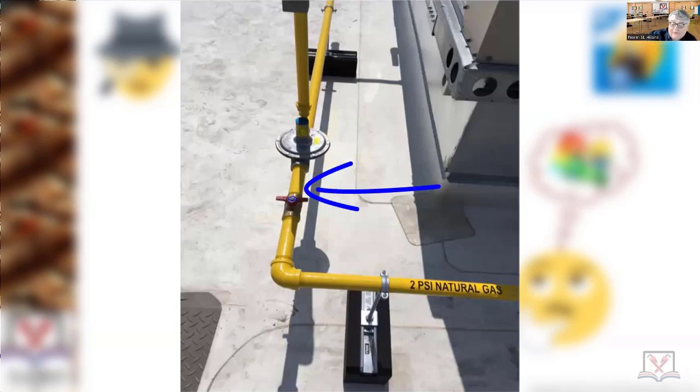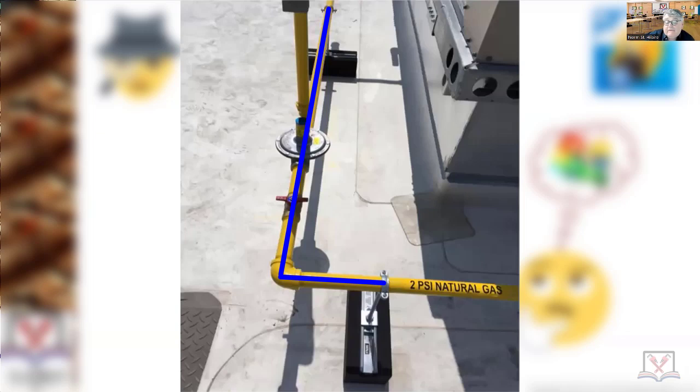I would have put one right in there somewhere too, and I think some of you on screen would do that too. But when you become an inspector and you know that requirement about how far hangers are really going to be apart — which a lot of students taking exams right now are saying they better know their hanging distances — if that's eight feet, that's all I can do. It doesn't say anything about putting hangers at every change of direction for steel pipe or copper tubing. It does for some other things, like no-hub pipe. When I'm hanging no-hub cast iron it literally tells me how many hangers I get to put on a corner, on three fittings, all that kind of stuff — but here it doesn't.